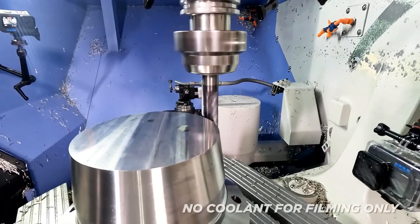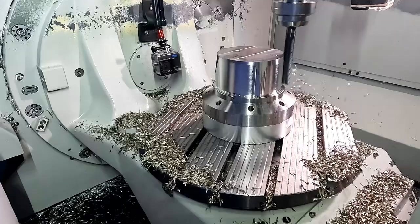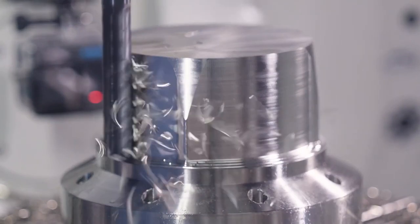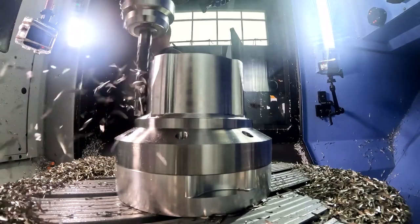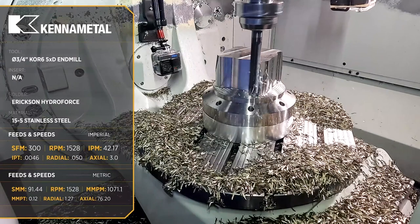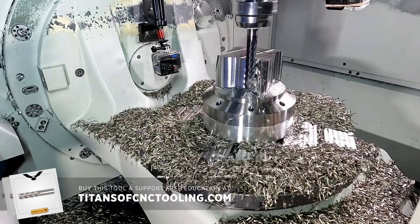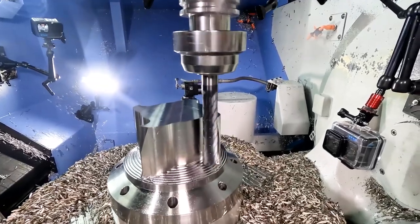It all comes down to communication. You need to look at all your stuff, make sure everything is good on your end — and so does the machinist or whoever's on the opposite end. Sweep from under your own doorstep before you go to somebody else's. Check your own setup, go through everything you know to check, get on apps like Novo or the manufacturer's website, find the drill or whatever tool it is, look up the recommended feeds and speeds, and see if that's where it's programmed.